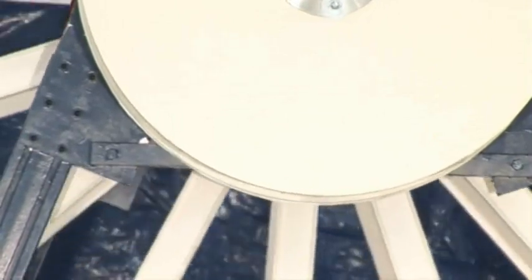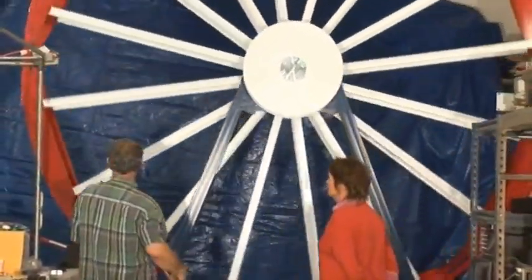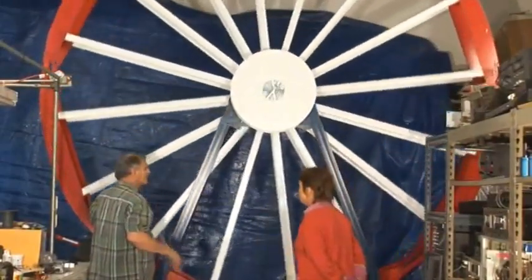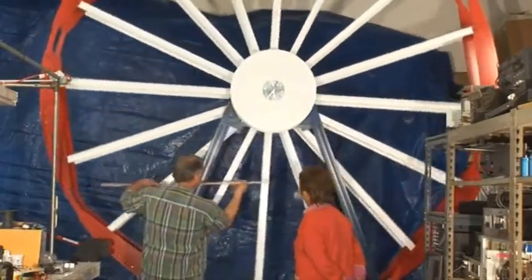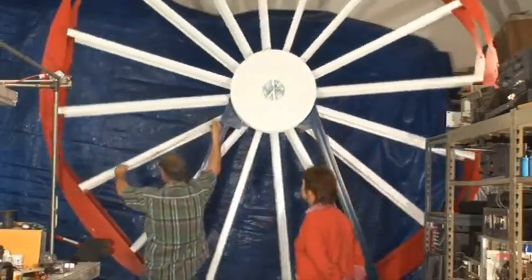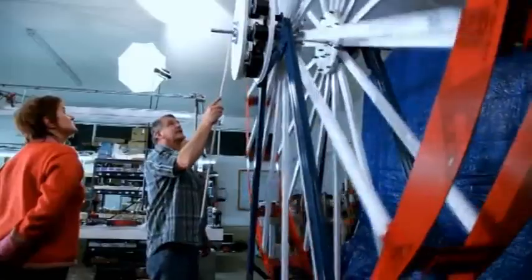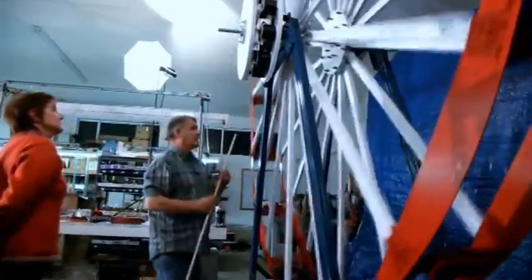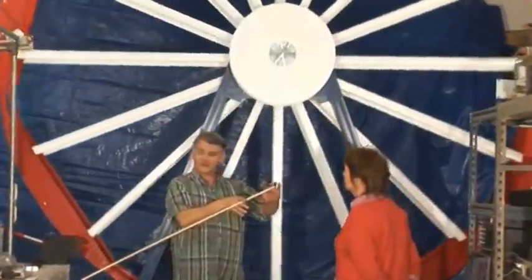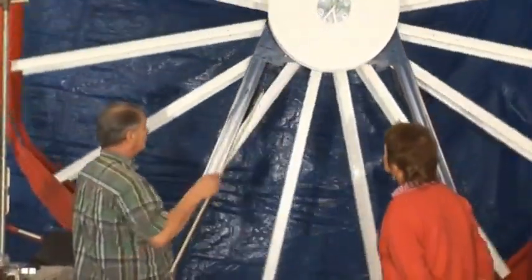That's why you see that happening. Here's the problem: you have this big lever that's six feet, so the force out here can be very little and the torque in here can be very great — because it's a lever. I've got two thousand pounds here and an ant lifting the two thousand pounds — that's easy for this wheel this way. But this lever goes directly to the shaft, and it has to be enormous in torque to lift in that direction.